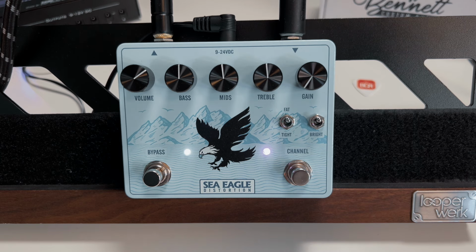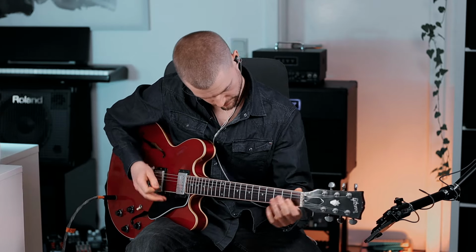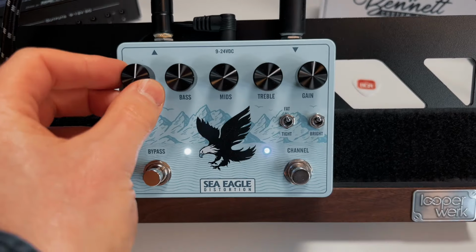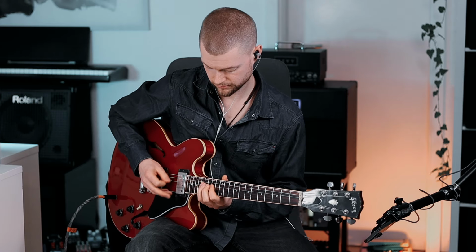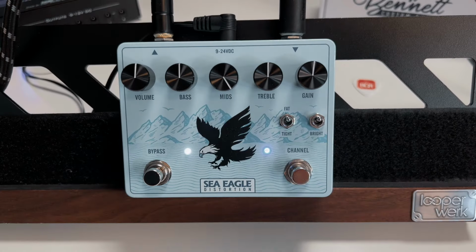And then let's start playing with the EQ. Here, with the gain knob all the way to the left, you might go for like a treble booster sound. So the mid frequency is around 500 Hertz, the treble frequency is around 1.2K Hertz, 1200 Hertz. And let's actually hear the mids cranked.